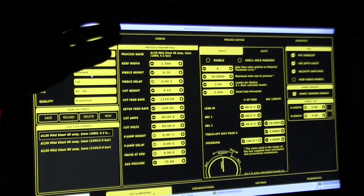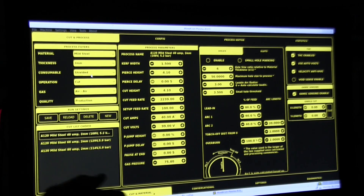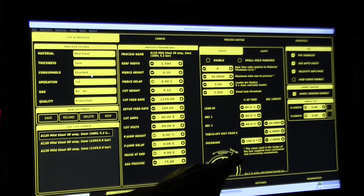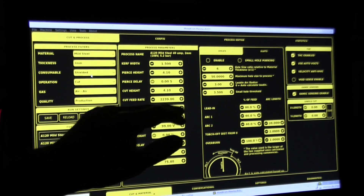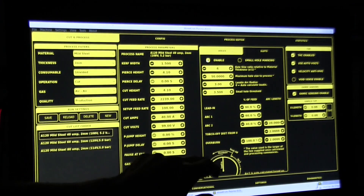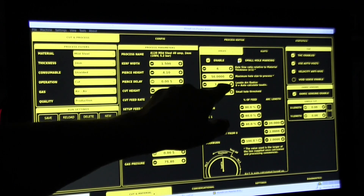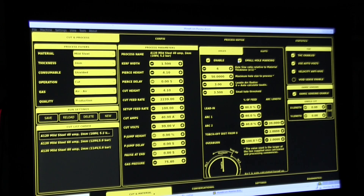Here are the parameters that have been pulled out of the database for this material. We've built in a default smart hole processing which is what we're using to cut this material. I want to enable smart hole cutting and also enable small hole piercing, so anything under three and a half millimetres in diameter will get spotted. The advantage of this is that in normal SheetCam you've got to create a spotting layer to spot the holes that need spotting, and then go through and cut the part out. This will be much more efficient as it will just take one pass over the plate.